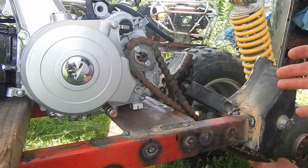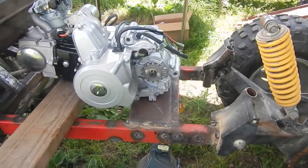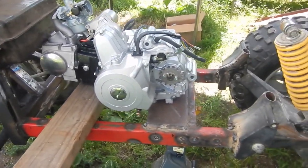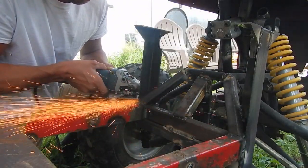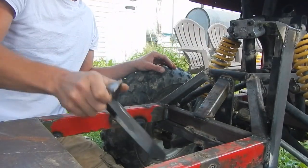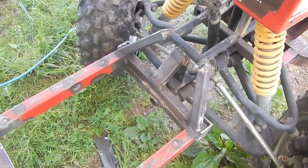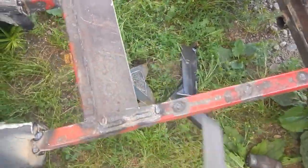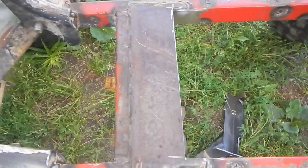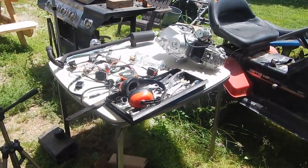It's just colliding with that little engine mount thingy - I didn't think to look at that initially. Hindsight is always 20/20. With all that being said, we're gonna try to push forward and make some progress today. I want to get this engine mounted and locked down. So we got that ugliness chopped off there, as well as about a one-inch-wide strip of metal. Now we can work on mapping out some bolt hole locations and hopefully get that motor pinned down into the frame.